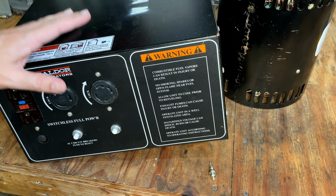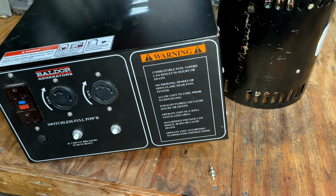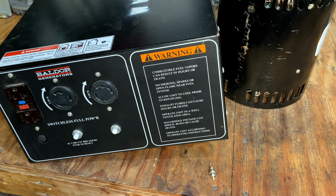So it's going to be a few days before I get that new diode. I really only have two housekeeping things to do. I need to tighten that bolt on the rotor, and the bottom rail where the stator mounts is rusted pretty bad. So I'm going to get some fresh paint on that now. There's no better time than when that stator is off.